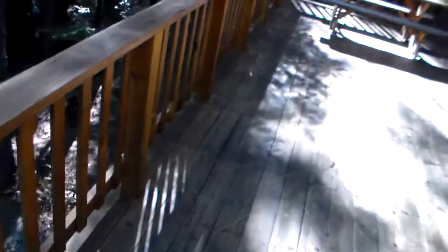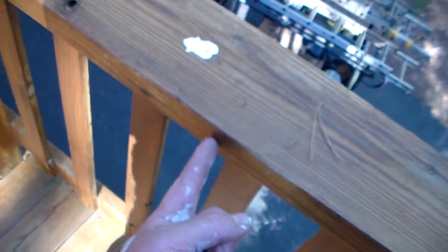The deck looks like it was done with a water-based stain at some point — not sure why people do that. What we do is sand it nice and flat and smooth all the way down, from this edge to this far edge right here. Two guys with battery-operated palm sanders takes about half an hour. Once it's sanded you have something solid to lean on. This deck is going to have to be stripped pretty good, but that's par for the course. Then we walk through and find anything that creaks — if it creaks it gets a screw. If it's sticking up and it's a creaker, it gets a screw too.